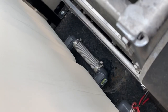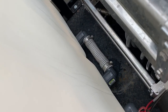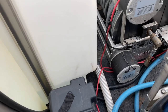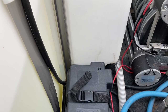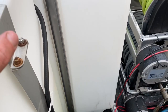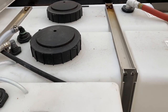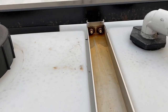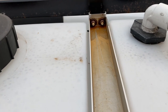There is another video on my channel that shows you how I plumb these up. So if you have any questions about the plumbing, these two tanks are plumbed together. That's 1.5 inch, and then 1.5 inch coming out. And these are the water dragon tanks. I did have a lot of questions about that. They are sold only at the power wash store that I know of. And then they have the stainless steel brackets that go over them. The bolts that came with them are starting to rust out. This thing's only been going less than a year, so I'll change that out.